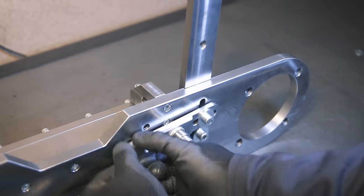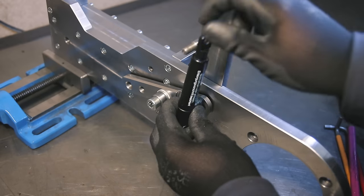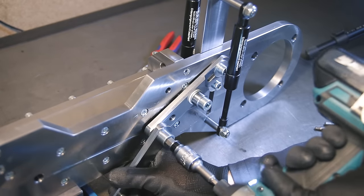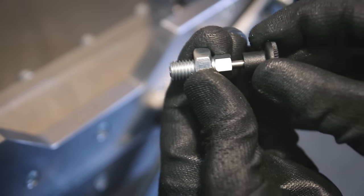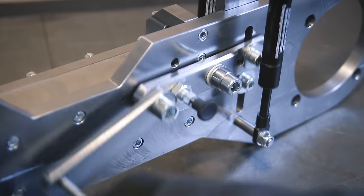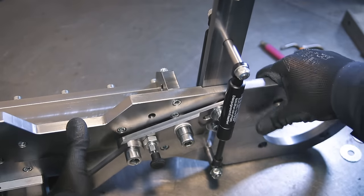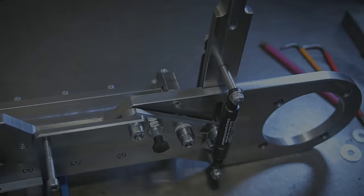Looks like that works, so now I can attach the gas springs. These are two 90-newton gas springs, and like I said earlier I eventually changed this setup to just use one spring on the drive side that has twice the amount of pressure - which is a bit more elegant and gave me slightly better overall tension, but this method also worked okay. Here's one of my favorite features: this entire mechanism actually locks into place automatically in the retracted position using this spring plunger, which allows you to easily change the belt without having to hold anything. When you're done, you simply pull out the pin and it unlocks.